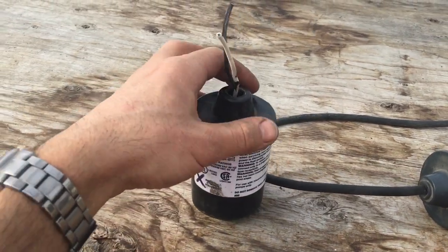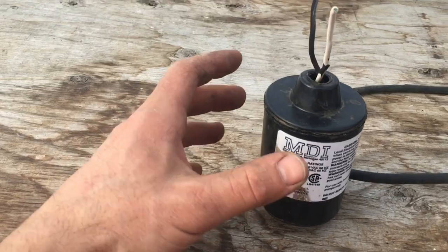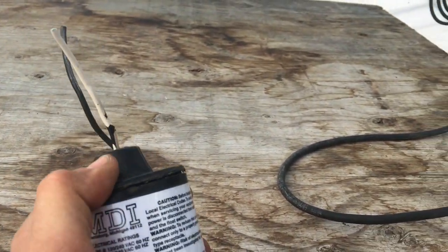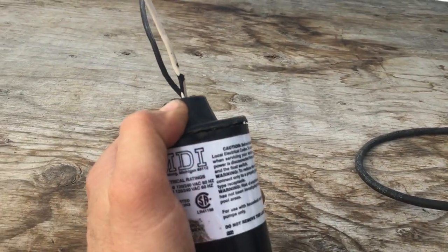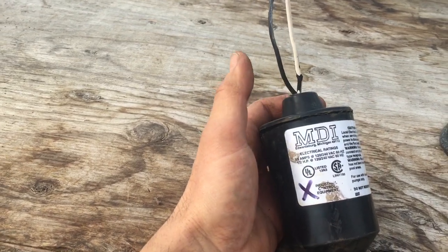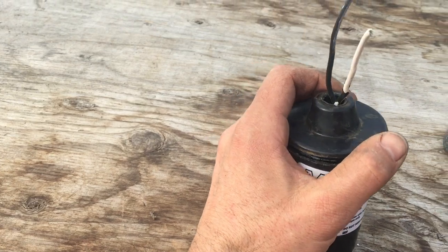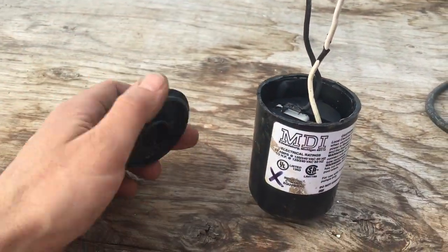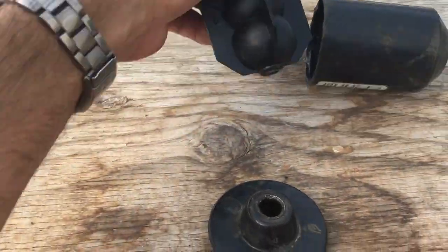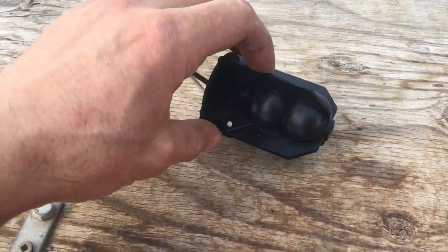It died in that water got in through the glue-filled collar, and so it's not on a GFI, and therefore we could feel the ground fault through the water. And so I shut it off, and I'm replacing it before starting the new season. But I was curious how they build these, so I took the liberty of cutting the lid off this with a hacksaw, and now I can show you the fiendishly clever and simple mechanism that makes that switch.